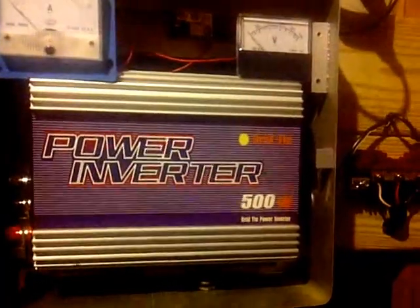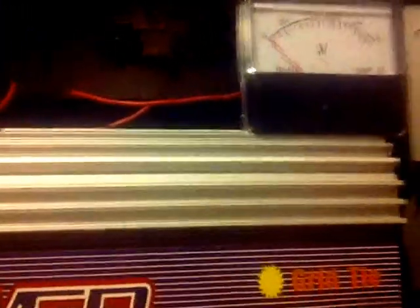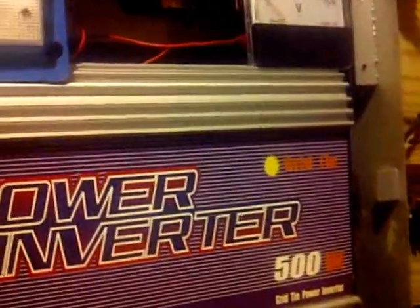Just wanted to do a quick video to show you guys how to do this. Again, there's the rectifier, and the two little wires go to the voltmeter. Positive goes over to the amp meter shunt. Off the shunt goes right to the grid-tied inverter. Your shunt has to match — so if you have a 50 millivolt shunt, then you'll have a 50 millivolt amp meter. The shunt and the meter have to match with the millivolts.